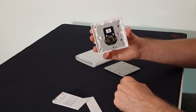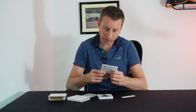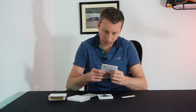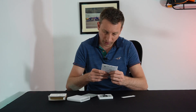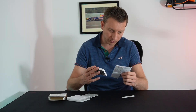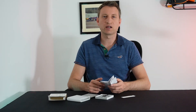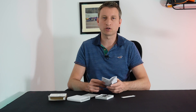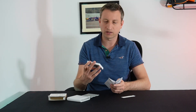It hasn't come with a battery, so we're going to need to install one. Looking at the manual, each button can have a single click, double click, or long press — so with four buttons you've got 12 different actions you can perform. To get it into pairing mode you have to hold the first button down for 10 seconds.